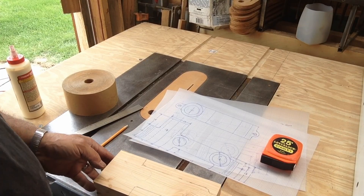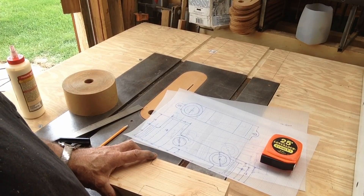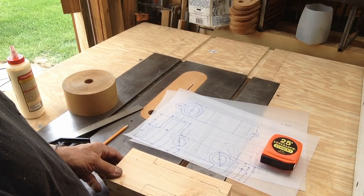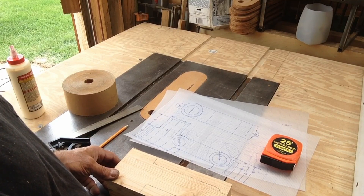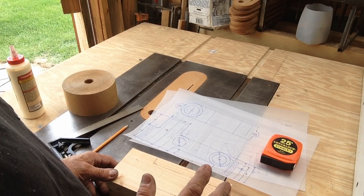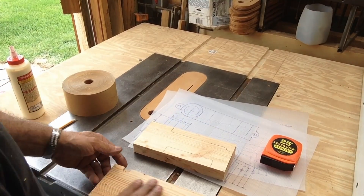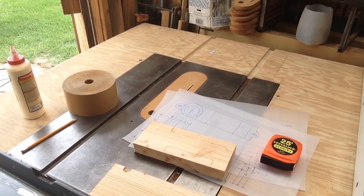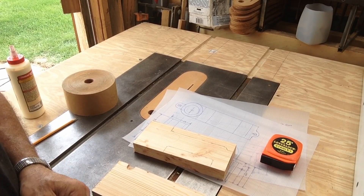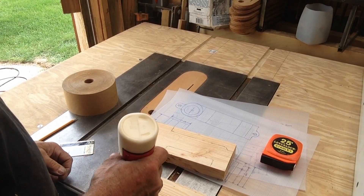The easiest way to do this so we can separate the two halves — when I add the bosses and the rest of the material up on top, we'll have to orient the split on those two to match up with the center line. It's easier to piece them together on a small pattern like this than to try to make it into one piece and sand the actual contours. I get a nicer round surface and can blend a little bit better. So we run a coat of glue down through here. There was a bobble where we'd cut something on the inside of the pattern — it's not going to affect anything there.